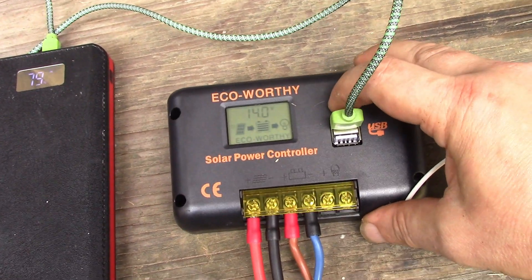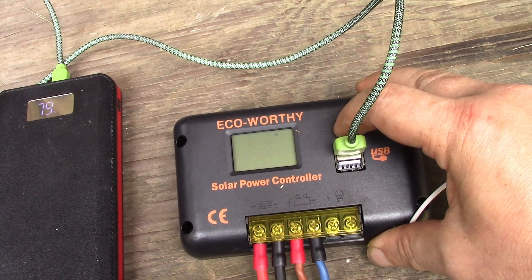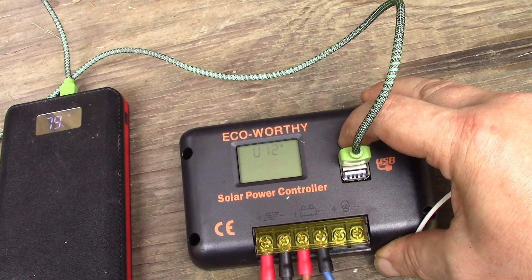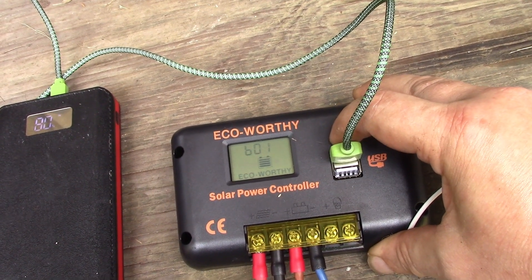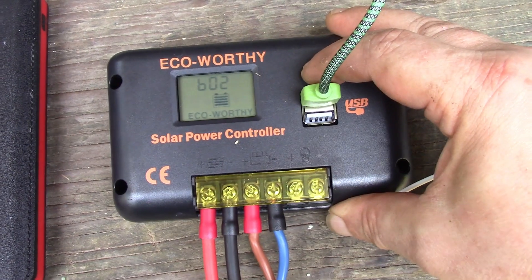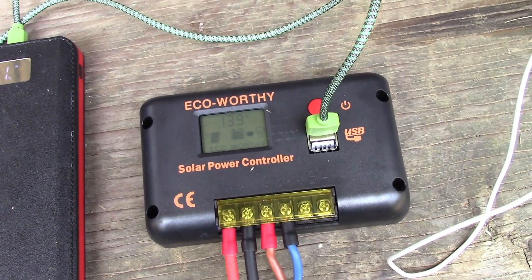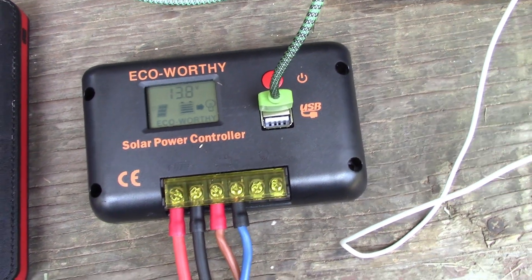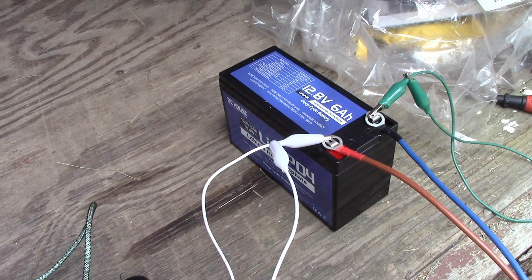One thing we've got to do is set the kind of battery. Keep that button pressed - it says U12V. Keep it pressed again, and now press quickly. There's 24 volts, that's 12 volts. To make sure that's set to 12 volts, long press. Bo1 is a regular gel type of lead acid, so I'll need to change that to lithium. Bo2 is LiFePO4, LFP lithiums, and Bo3 is for SLA sealed lead acid - so it needs to be on Bo2 for this. But everything works, that's great. The only extra you need is some form of storage; in this case I've got that 12 volt battery, but any old 12 volt battery will work.